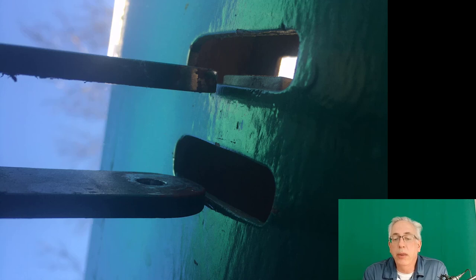But really, once you get that final arc completed, then the wing attach brackets will line up with the spar. You have to almost bend them a little bit, especially the aft one, which has to be pulled back a little bit so it clears the spar carry through on completion of its arc, and then it gets snugged back up and the bolt or pin gets put in to attach the wing to the spar carry through.